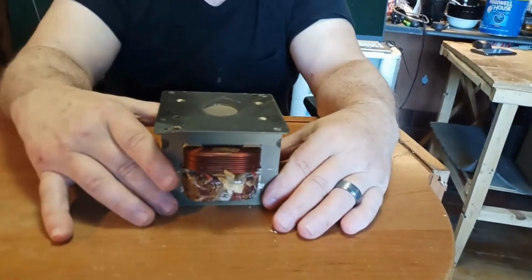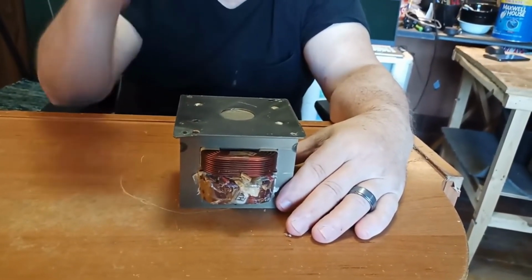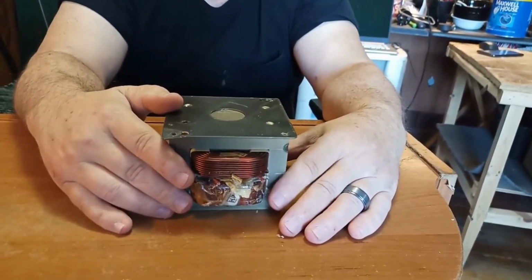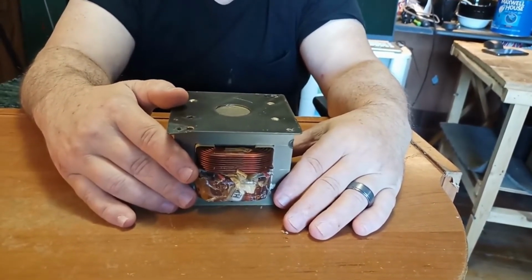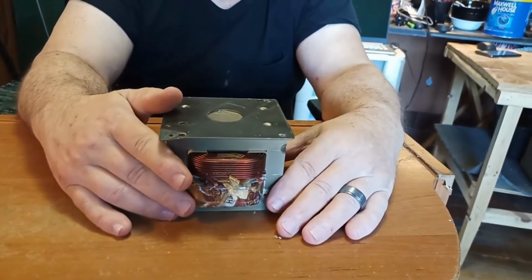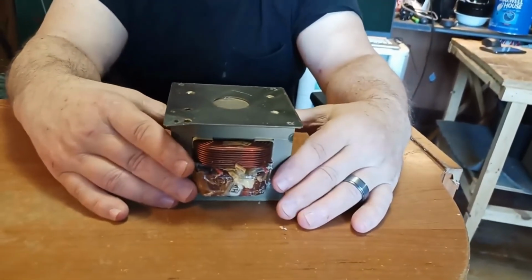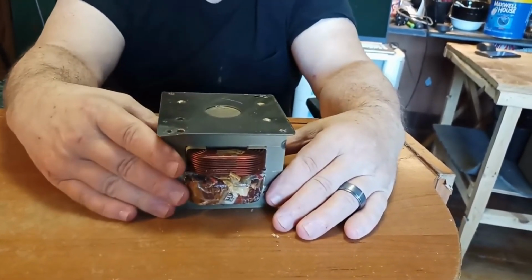It was a good thing that we went with a new water heater, because there would have been no changing out the elements on that thing this time. They were locked in. I could not get them loose at all, and that was using a wrench that's designed for taking out and putting in those elements. Would not budge. Pipe wrench would not budge. So it was done. The bottom line to it, I took off the pop-off valve on that thing. There's some slimy, sludgy stuff inside of there. So it's just a good thing we went and did with a new water heater, because that one was just flat out done. Any way you slice it, it was done.